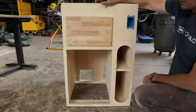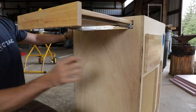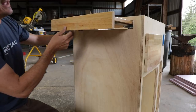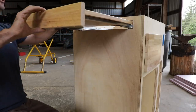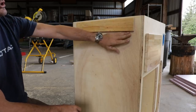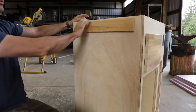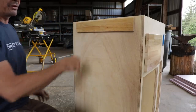All in all, there's a ton of storage in this little cabinet. On the left side I put a face on the pull-out countertop, which will finish off the exposed hole. I had to do all of this by hand with a skill saw, so I took great pains to have clean square edges since it'll be kind of exposed. It's soft close. I think a little bit of wood accent would look good against the Formica. We'll put a low-profile pull on there, and the lip is going to prevent things from being pushed or slid off the edge onto the bed.